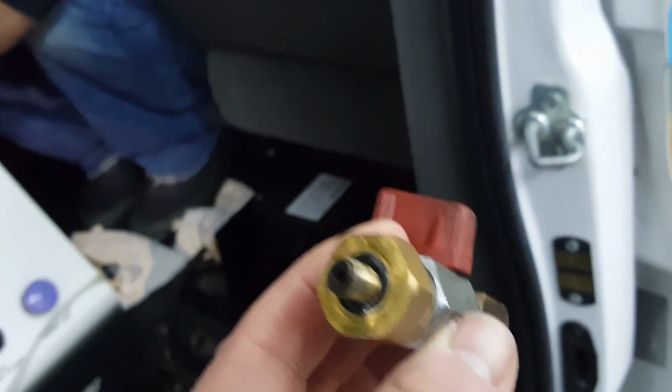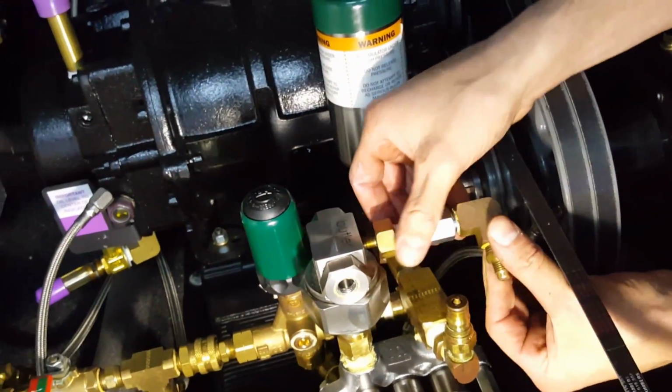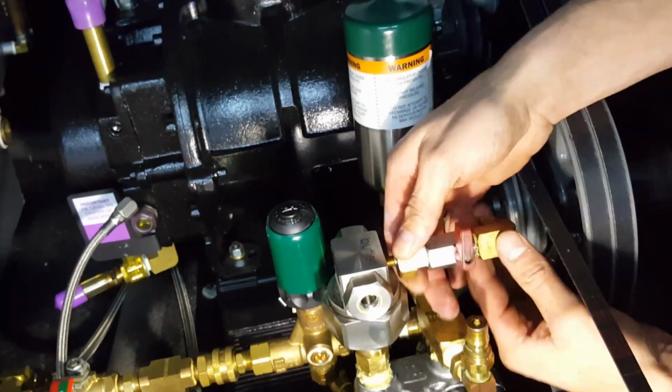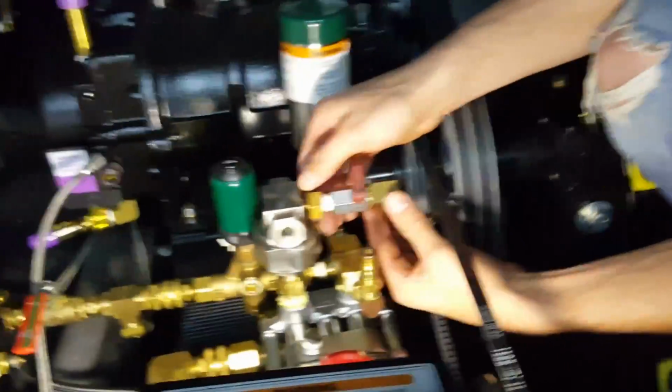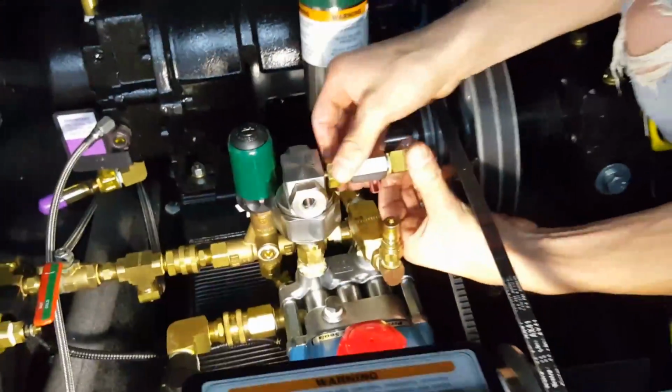All right, hand tighten that in position. Now, remember this little part I told you about? That's going to go in the end of the bleeder, that you don't want to break off. There's no pipe dope or any Teflon you put on there because of the rubber washer. So he's just going to get it in there and he's going to be careful. He's not going to over tighten that. He's going to tighten that by hand, get that in position. We might actually wrench just a snug to get the angle we need so that the hose coming up the back there hooks into that.